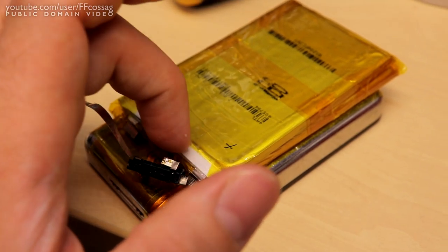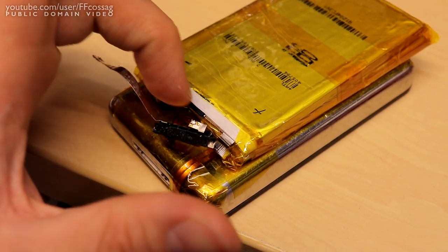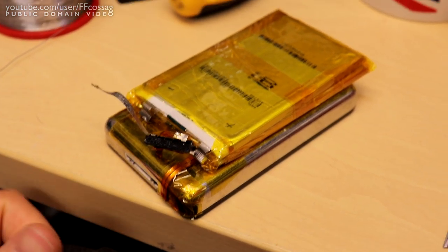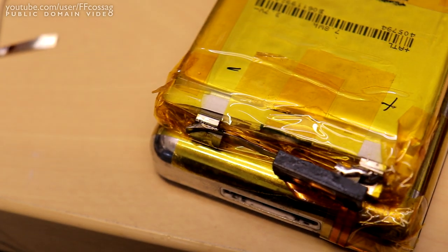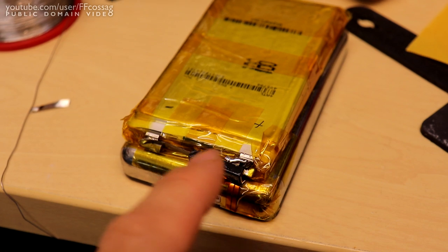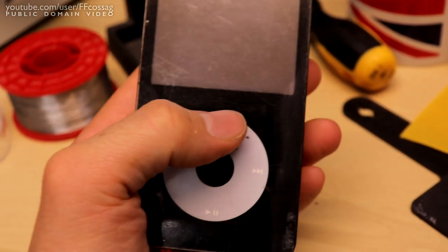These leads are going to fit quite well. I'm going to have to put some extra Kapton tape there to make sure nothing shorts against any funny business along the edge of the battery, and then we'll just wrap with a lot more Kapton tape and I think we'll be done. There we have it all soldered up and taped in place. On this particular battery board for the iPod, the long lead is the negative, so as long as I did not screw those markings up, this thing should actually work now.